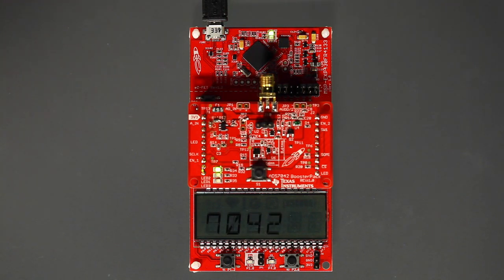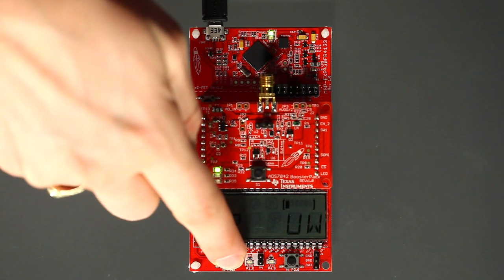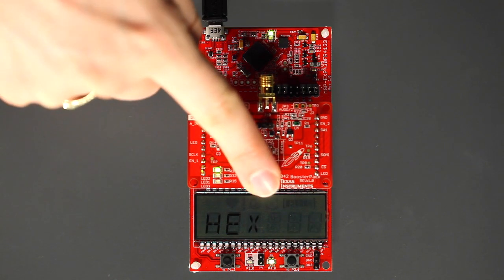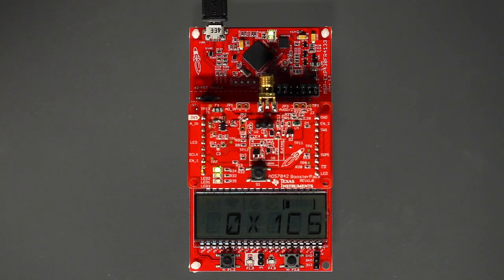At this point, you should see text display on the LCD of the MSP430FR4133 Launchpad, showing an introduction routine, followed by the measured power consumption of the ADC and voltage reference of the Booster Pack. You can change the sampling rate of the ADC by pressing Switch S1 and S2 on the Launchpad. Switch S1 changes the display from power consumption to raw hex data. This is also output over a USB cable and can be read over a COM port on the PC.